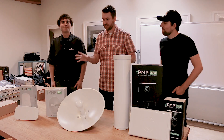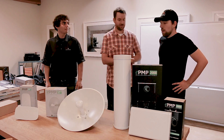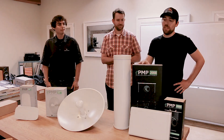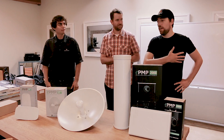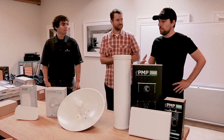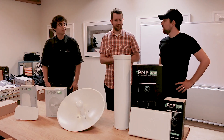We've got all the equipment laid out on the table. We're going to be pushing a backhaul link to our main tower and using this as a point-to-multipoint system. We'll start with the 90-degree sector up and see how clients are connecting to it, what kind of speeds we're getting given our noise and interference in the area, and just kind of see how it works.